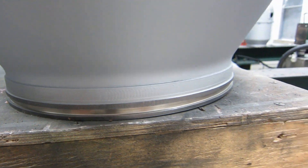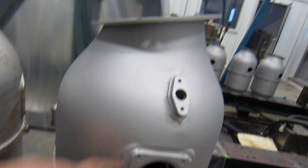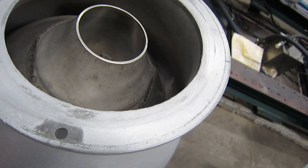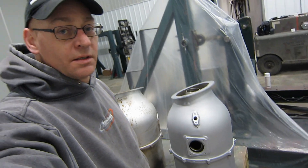There's a groove down here where a silicone O-ring goes that seals the combustor air from escaping as it travels to the turbine. We've got to clean that out - and by clean, I mean like that. This one here was in the exact same condition as that one there. It's about a foot in diameter, maybe 14 inches. There's an igniter boss - this is an igniter can. This one's got a brand new liner installed. It's about the size of a fender of a car, but it takes more than a day of intense work to get it ready to paint. Then we apply the high temperature paint, let it cure for a while, and it's good.